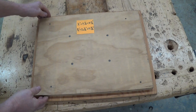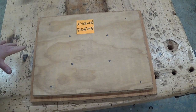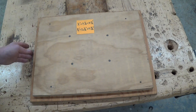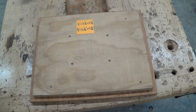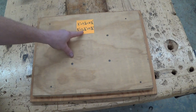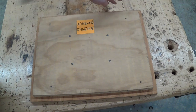That gives us a sixteenth of an inch of wiggle room on the inside, so it'll fit on there nicely. This outside piece is slightly smaller than the outside dimension of the standard Bee Box — it's three-quarters thick, and it's 16 and 3 sixteenths wide and 19 and 3 sixteenths long.